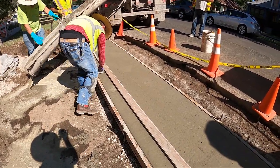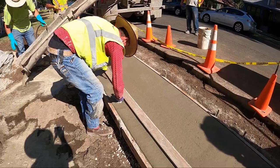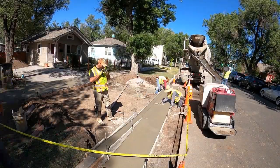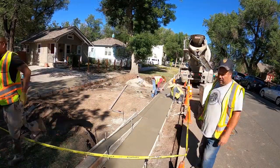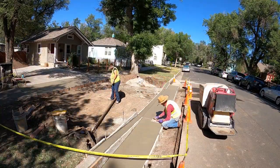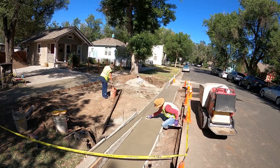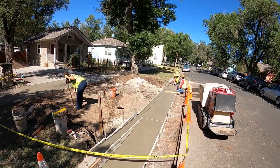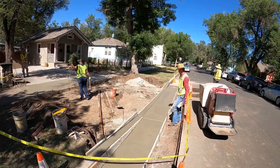I mean, it wouldn't hurt him to put some of those aluminum and fiberglass into these things up there. One small detail I didn't like about this pour is we had exactly enough concrete, as in just a few shovels left, and we should normally have a quarter to a half a yard left. So I was really uncomfortable when we scraped off the buggy and had just enough for the job, which was cool, but shouldn't be that way.